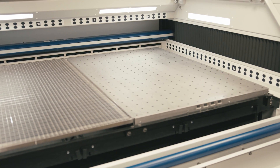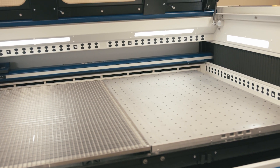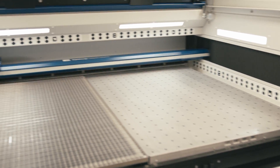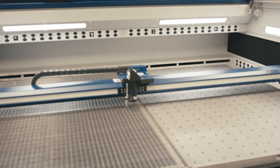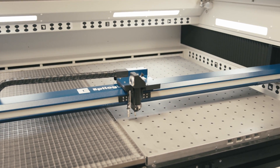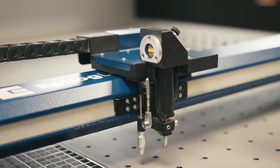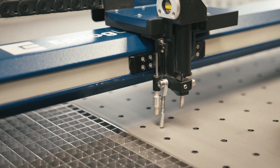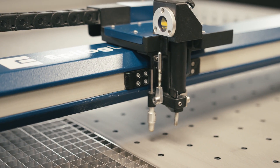I'm also going to show you our lens assembly setup here on the control panel of the laser. I'm going to jog the lens assembly a little bit closer to the front of the machine so we can have better access to it. All of our Fusion Pro machines have a really unique manual focus gauge — it just flips down. Raise the table until your material touches the gauge, move the gauge out of the way, and you're ready to go.